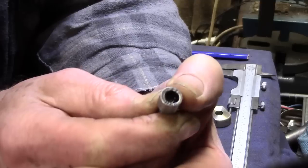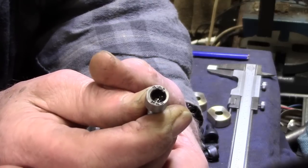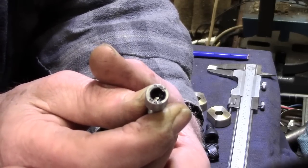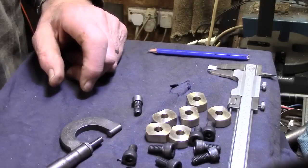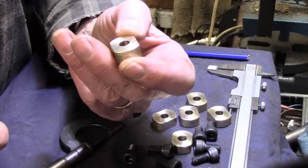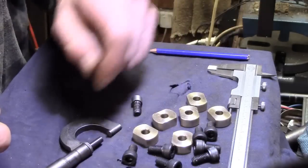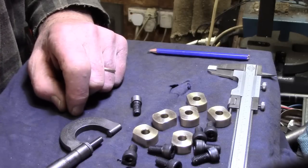We'll have to have probably a little bit of lube inside the brass so it doesn't wear away too quick. Although there again, lube might be a disadvantage. We'll have to see. They're not going to be used that often. Anyway, we'll get these other bolts done, and then hopefully we can move to the mill, and I'll relieve what was the 8mm clearance hole. I'll relieve those to a suitable size when I can see what amount is needed to get the full effect.